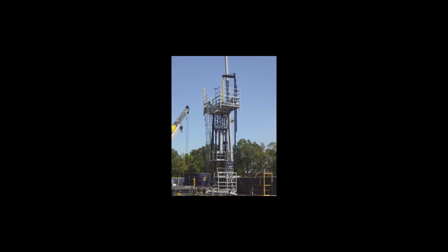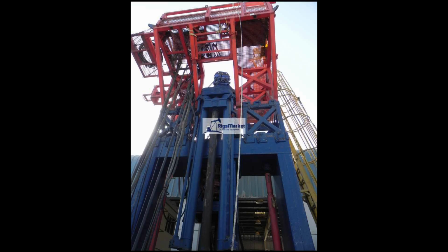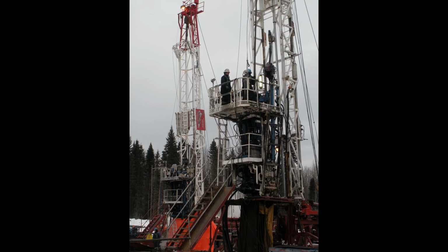While pulling out of hole, one stripping ram was not opened sufficiently and a collar on the pipe string caught on the ram. The excessive force applied to the pipe caused it to break apart, dropping the string below the failure into the well. In the time it took to prepare to fish out the pipe, the pebbles in the process of being circulated out settled on the pipe, preventing successful fishing.